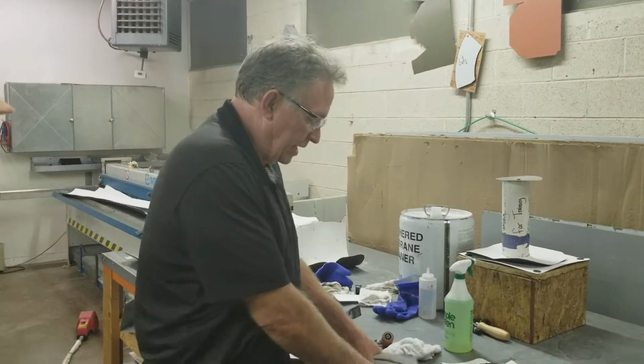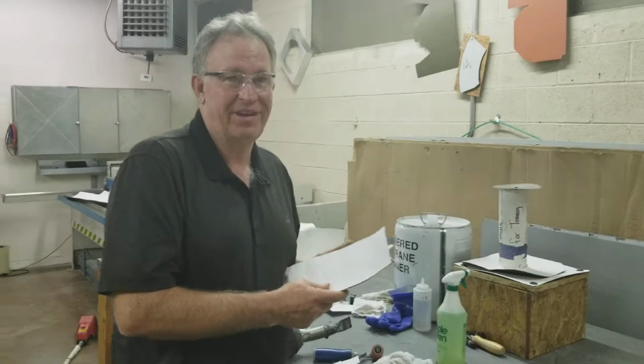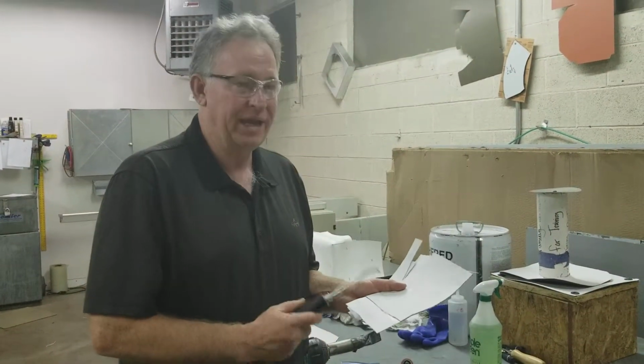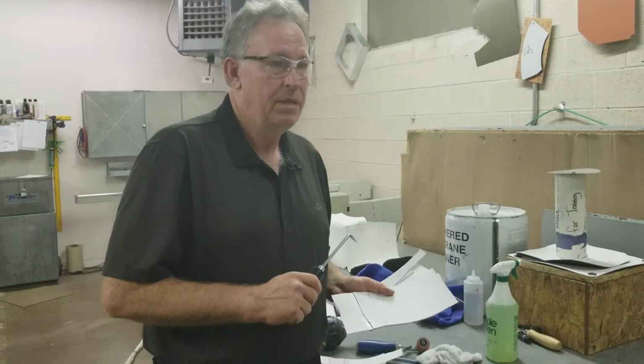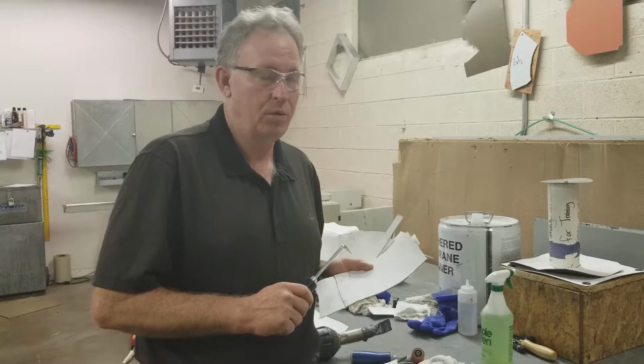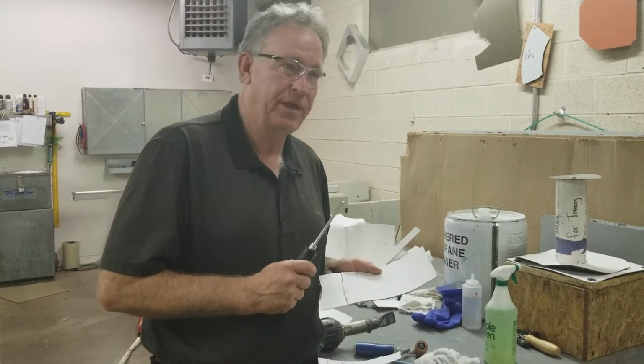And you don't want to get out there and weld a whole bunch of stuff out on the roof. I probed it. I found one void. I heated that void down, but my seam was not functioning. So we will record another video with a good seam.